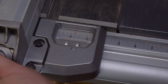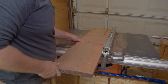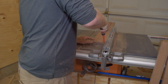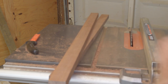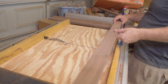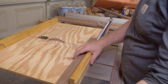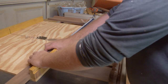After I got the slab and the step cleaned up, it was time to cut the cross members and legs for the rest of the stool. Having a riving knife on this new saw made it a lot safer to rip these long cuts, especially because this walnut was under just a little bit of tension. Walnut machines really easily but you could still snag the blade and that can be dangerous. I trimmed these two and an eighth inch wide so I had a little bit to clean up on the planer and jointer, then ripped them long so I could cross cut them later. Since this was a scrap wood project, I didn't have specific measurements — I just knew I wanted around 24 inches tall with four legs the same length and two diagonal pieces a little bit longer.